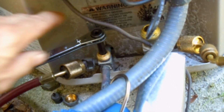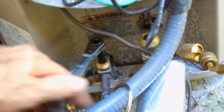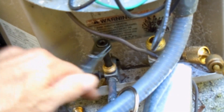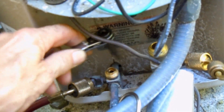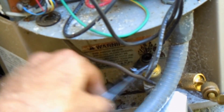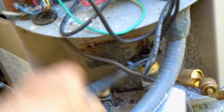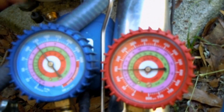What I'm going to do now is just show you how to release the gas back into the line set — that's quite simple, really kind of just doing things in reverse. First, while the system is not running, we'll open the liquid side, and you can probably hear the gas rushing back into the line set. Open the liquid side all the way. Good. Then I'll do the same thing with the suction — open up the suction valve.